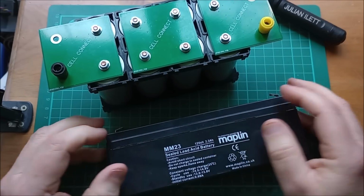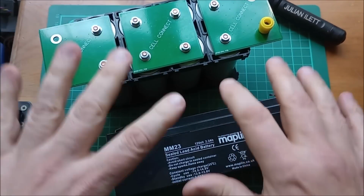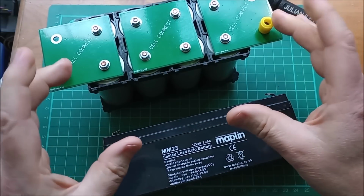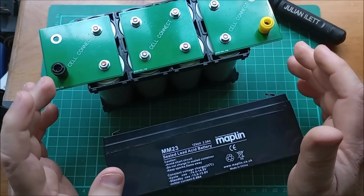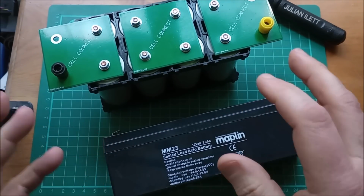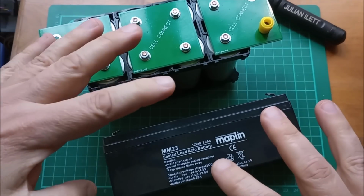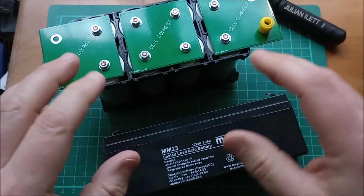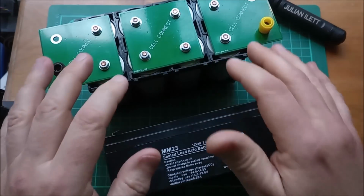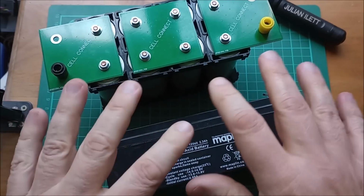And in fact, the voltages will immediately or fairly quickly become the same. I mean, as soon as you connect the two batteries together, they have to be the same voltage. So there won't be any force, electromotive force, driving energy from one battery to the other. They'll just become the same voltage. There may be a small current for a while, and therefore a small transfer of charge or transfer of energy, but there's nothing to keep driving the process.